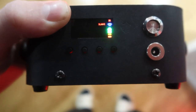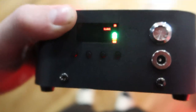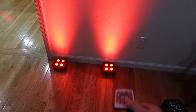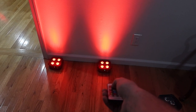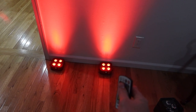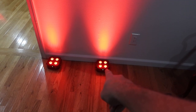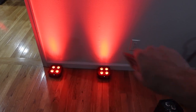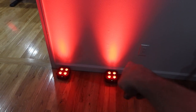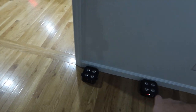It says slave on the screen. It was on DMX mode, sat for a second, then went to slave. You'll notice the wireless DMX signal is flashing to indicate it's receiving signal from the master. Now here's why you might want to turn off IR on slave lights: if I'm pointing the remote at one light to make it green, I might accidentally also tell the other light to go green. This becomes a problem in sound active or fade mode — you could accidentally create two masters, causing conflicts.